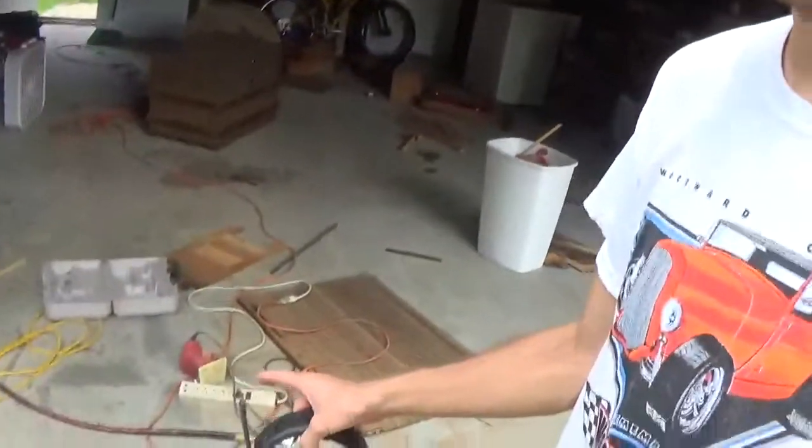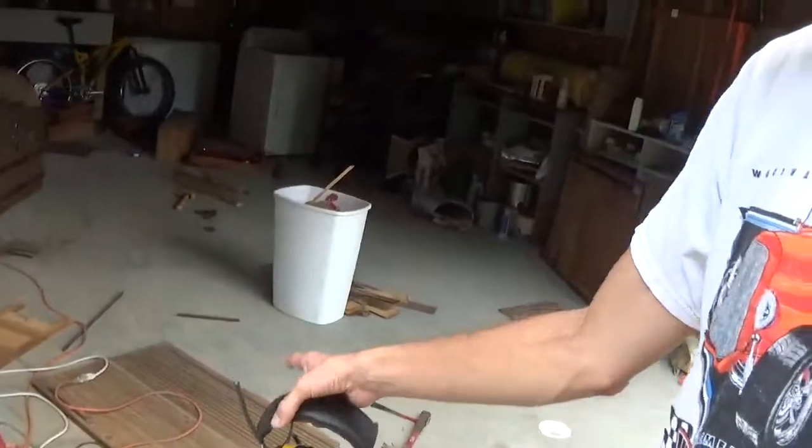Welcome back to the garage. This is day three or four working on the roll top desk. We're going to be continuing on the headpiece, which is right here behind me. I'll start hitting that with the 220 with the square sander, because my orbital sander is out of commission — the sanding pad fell off. I ordered a new one and it's on its way. If I get done with the headpiece, I'll go ahead and start on the roll top part of it.